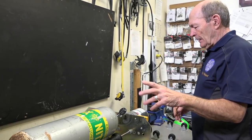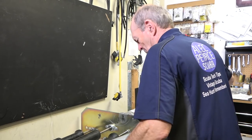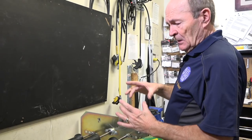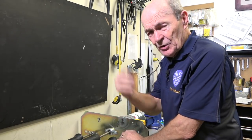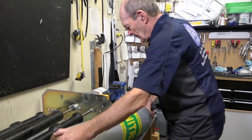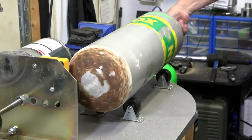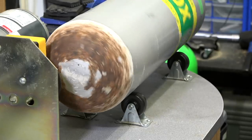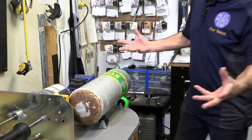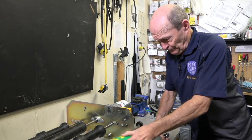Now, I did mention to the chap, when I sent out the information, that rather than this display, you can also use casters. You can go anywhere - Harbor Freight, Princess Auto, Home Depot - and go to the caster department. You know what casters are - they're wheels that go on the bottom of cabinets so you can move them around. They're just rubber wheels. Like these. Four rubber wheels - look at that. So you can use casters. Hook up a motor with a rubber roller to spin, and rather than having this long device, you can just have a couple of nice big casters. That is how a tumbler works and gives you some ideas on how it's possible to build your own tumbler.